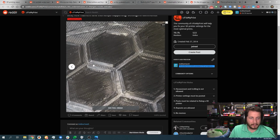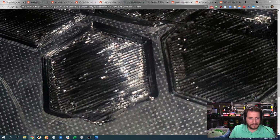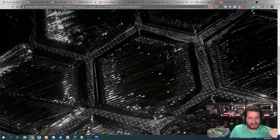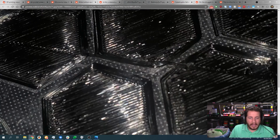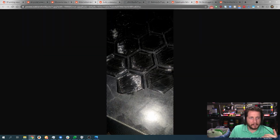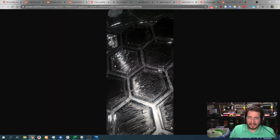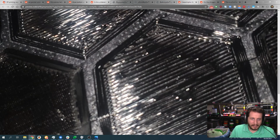I mean, although I'm only looking at vertical photos. The other issue that we have is the lighting is not great, so it's really difficult to see. But this is classic. It's too far from the bed. And because there is some sort of shmoo on there, be it glue, be it something else, it is affecting the adhesion properties of the bed. So parts are sticking when they shouldn't.